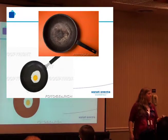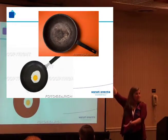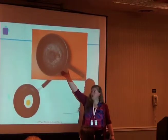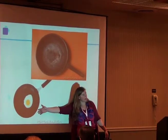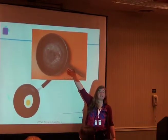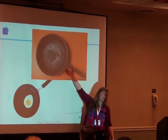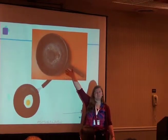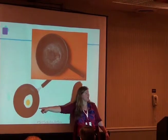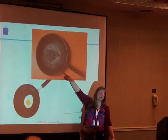Same thing for non-BAM. Notice the condition of your equipment. Are you trying to clean this frying pan, or the brand new frying pan? Some of us have legacy equipment that looks like this. They should be doing passivation and preventive maintenance. But if I do my cleaning validation on it now, and three years later it looks completely different, my cleaning validation is not valid anymore.